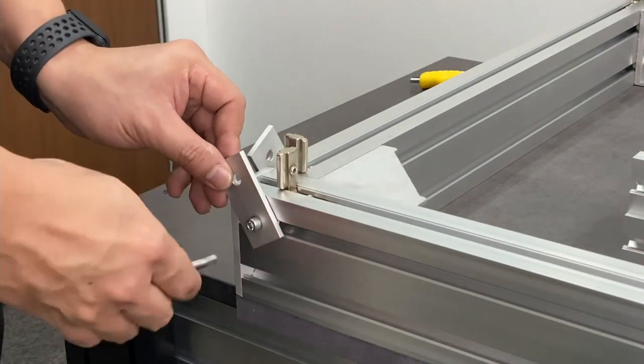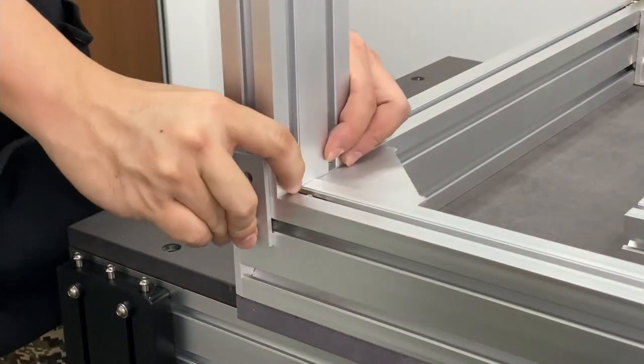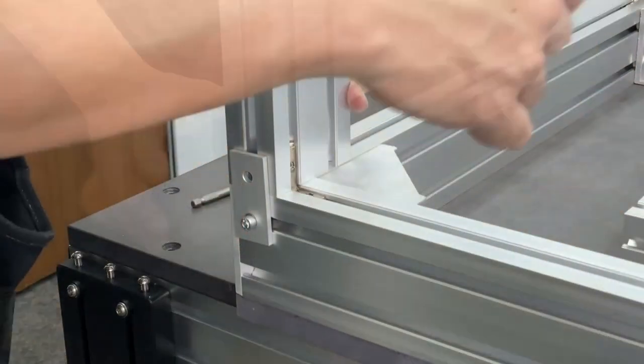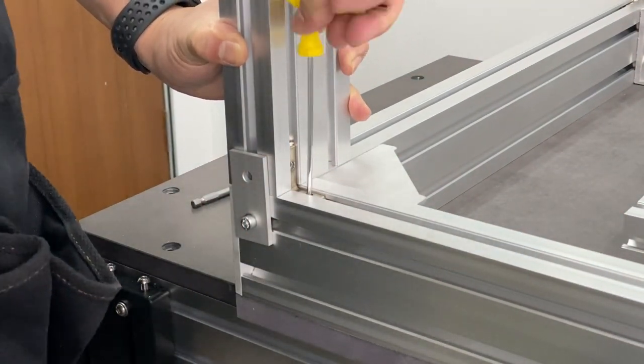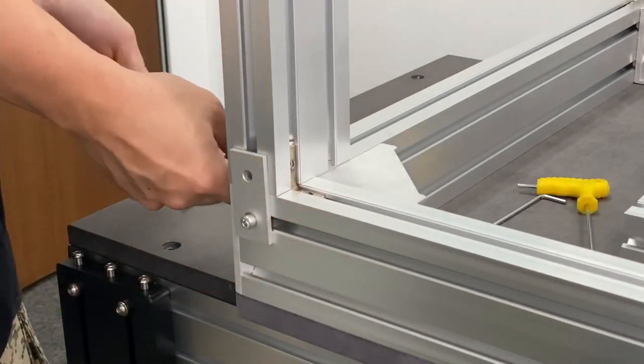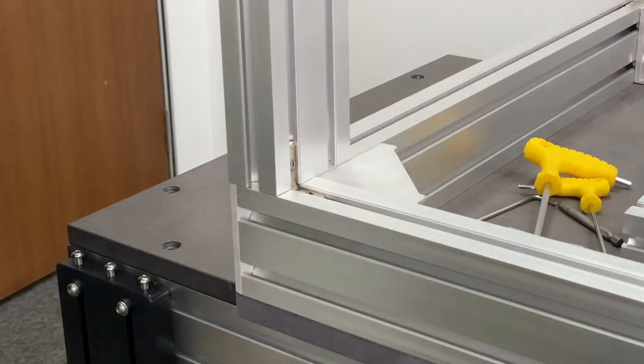This method is used to ensure that the legs sit flush with the table corners. Of course, tightening down the grub screws will also require a proper sequence so as to not pull things out of alignment. After that, all I need to do is to check through that everything is neat and tidy, square and plumb, every joint is cleanly flushed.